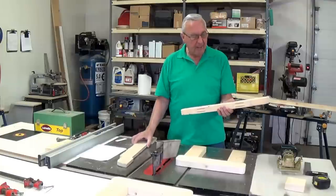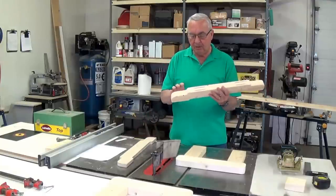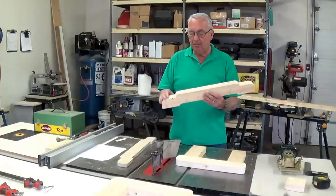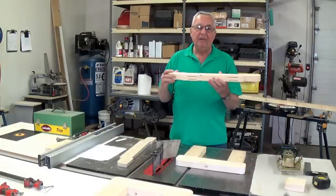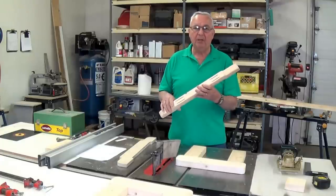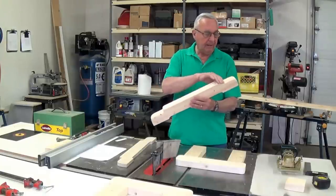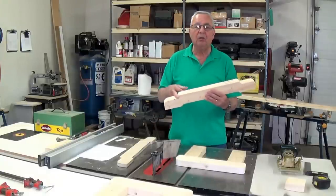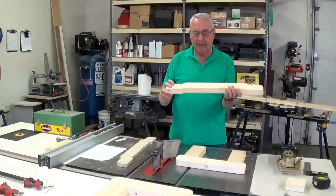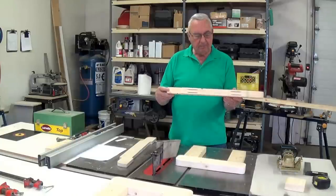And you can make your bases like this here. Now, this base, as you can see, has some curved ends and an indent in the bottom. I did this on my bandsaw, but if you don't have a bandsaw, a jigsaw will do the job just as well. And then after just sanding it nice and smooth, filing the corners where they need it, this type of thing, to make it a nice clean project right through the whole project.